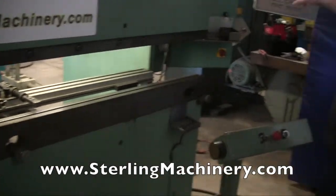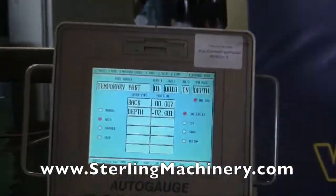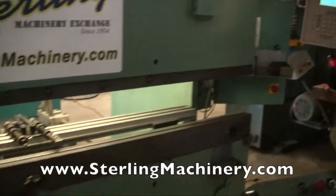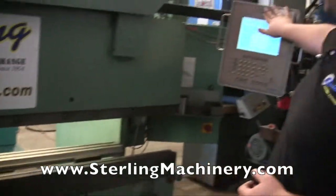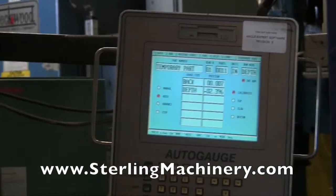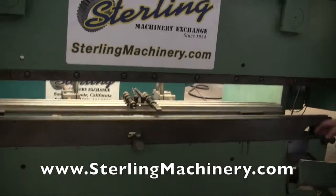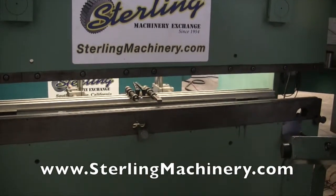That's a really nice feature with these Allsteel press brakes. On this controller you can program just about anything you want. You'll see you have your depth, the back gauge keeps moving into each position — as many positions as you put into it, it will keep moving for each job. You can also save to it by putting your disc in here. You'll also notice that the ram is a two-speed ram: fast approach, slow forming, and quick retreat — that's going to help you make your parts a lot quicker.